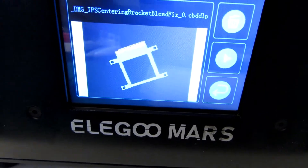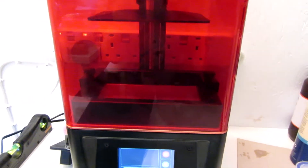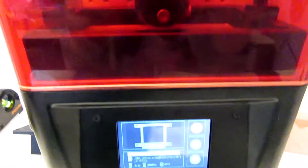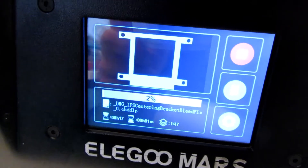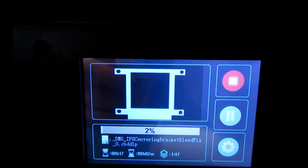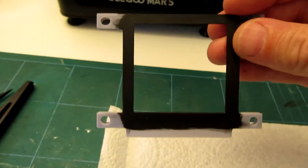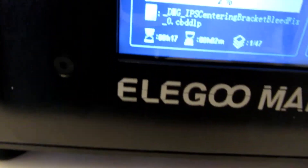That's the model we set up in there. All I'm going to do now is press the play button to set it to print. What's going to happen is the print bed will lower into the tank and start to expose one bit at a time. It's got a red filter hood over the top to stop any daylight getting in — I tend to have the blinds in my shed closed when I'm doing these prints, just in case. It shows me down here it's going to take just 17 minutes — if it was on an angle, I'd be looking at hours. The screen shows the layer it's doing at a time. There's a clear LCD with the UV light underneath, so whatever displays in black prevents the light from passing through, and the light passes through that shape. Then it swaps to the next layer and the next until they're all done. I'll come back in another 17 minutes.